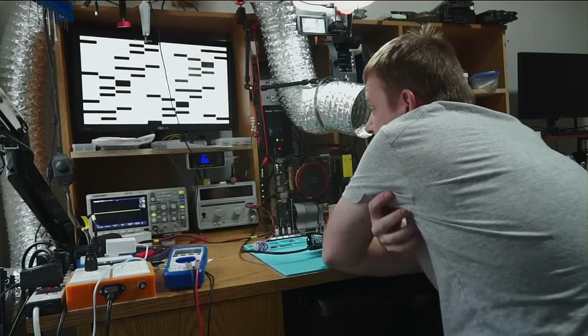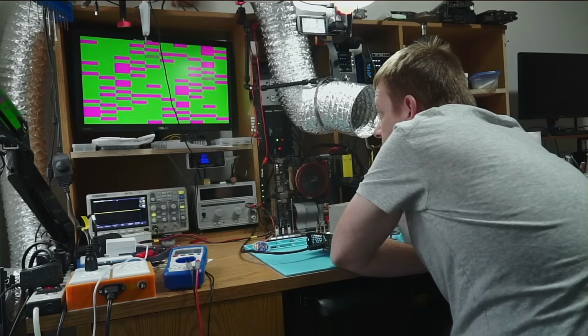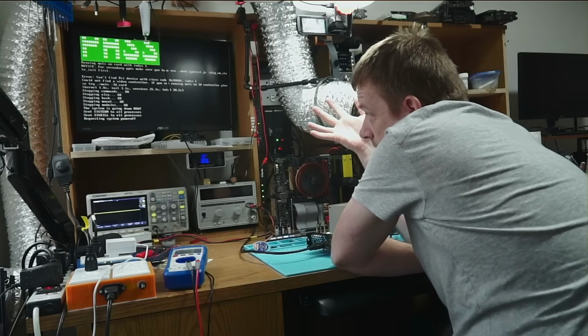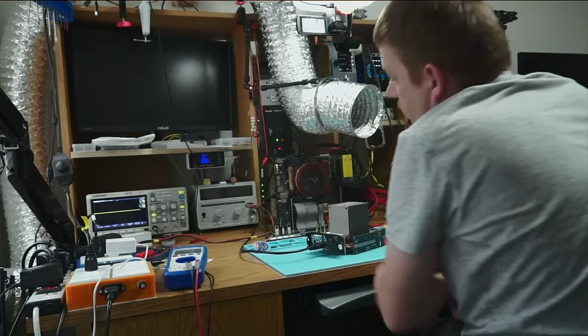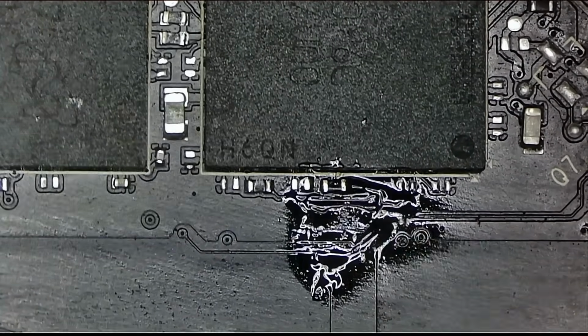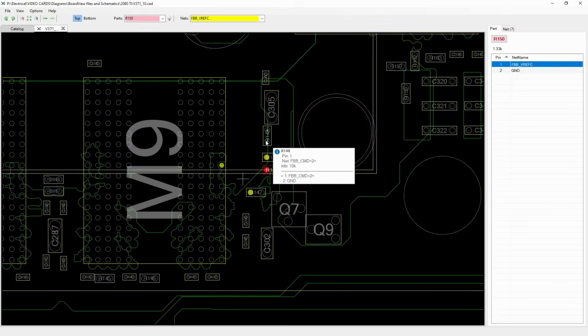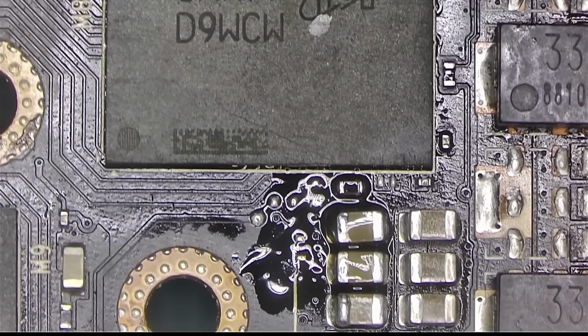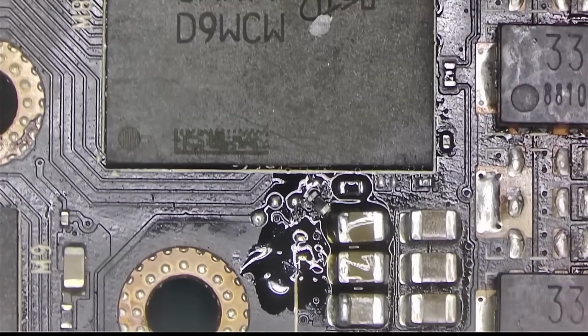I ran a memory test again. Everything looked clean, so what else could be wrong? What else could a mystery repairman do to screw it up so bad? After looking around and measuring all of the resistors around the memory chips, I noticed that some of them were soldered in the wrong place. More problems to fix, I guess. My disappointment is immeasurable, and my day is ruined.